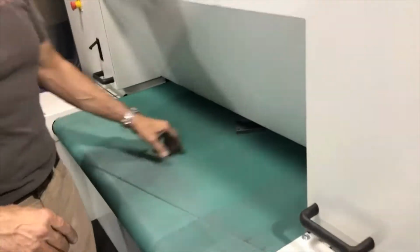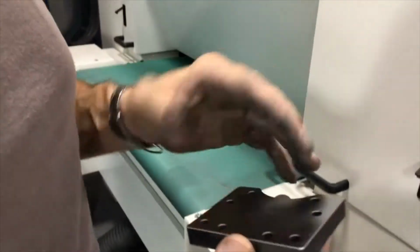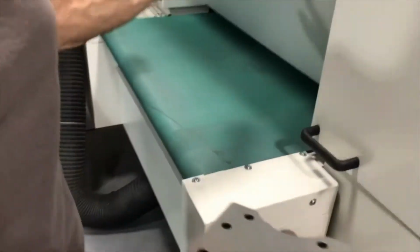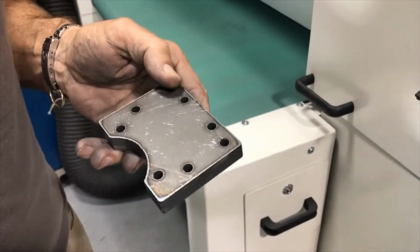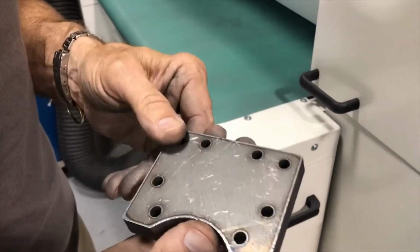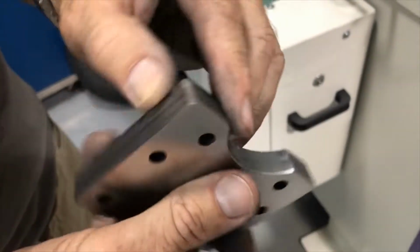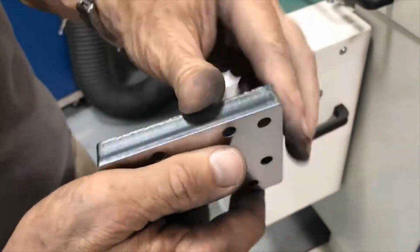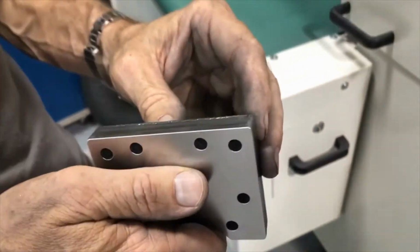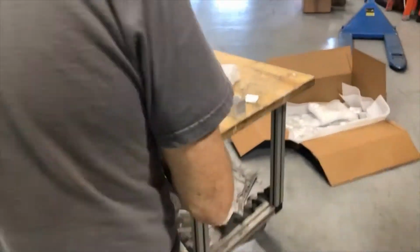So here you see the part coming out. It cleaned the surface, and we have a little bit of a radius edge because I kept the sanding belt on in the back, which you normally can't do because both brushes are new right now. They have similar length, so that is possible here. And you see that we removed the material going into here, but not really beyond the step, where in here we cleaned it almost all the way to the bottom on that side. And then here, hard to see. Oh, this side we haven't run yet, so that we need to do next.